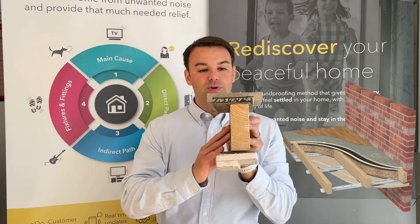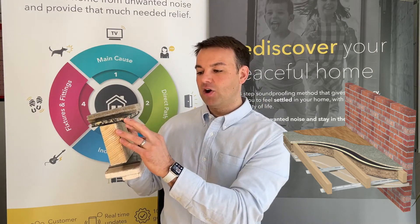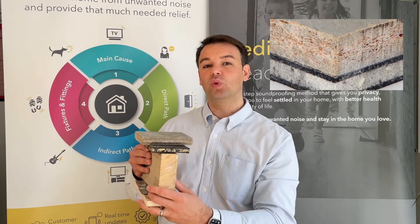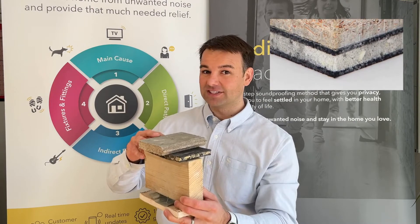It's really important to isolate the board from the walls all the way around, and completely seal up all those screw heads. You've got 100mm rock wool between the joists, and then on top of the joists you've got a sound deadening mat foam, followed by a cement particle board — not glued or screwed to the joists, and isolated from the wall all the way around. So it's a floating floor, glued together, not fixed to the joists.